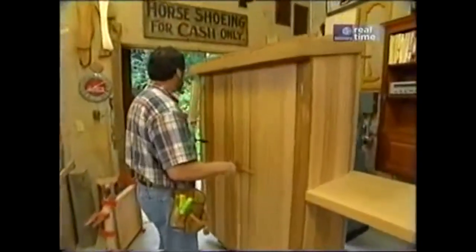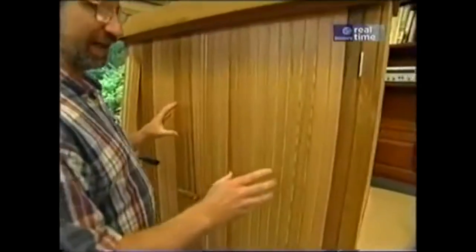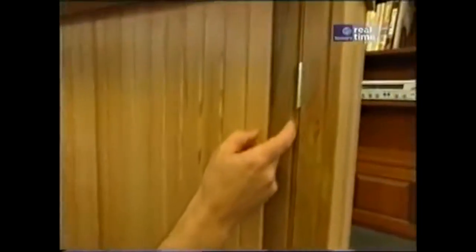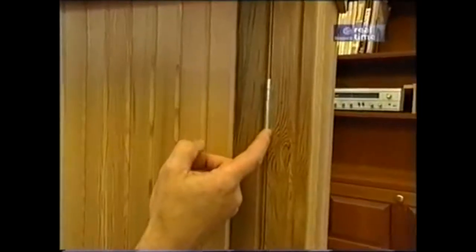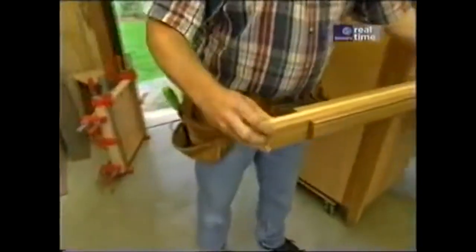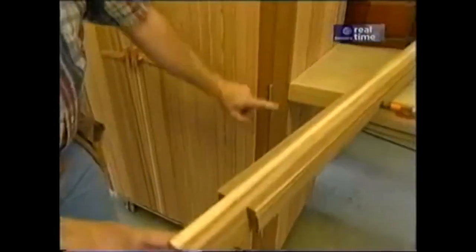While the shelf cooks, let's look at the prototype and start working on the doors. There were two ways I could have designed this piece — I could have built a face frame and hung the doors in between, or do what I did here: make it look like the siding is continuous right around the corner. So I made a joint right at the edge of one of the V-grooves, and that's where the hinge is located. I want to mortise these hinges into the door and to the fixed piece, because if I just use the screws, the weight of the door is hanging on the screws. By making a mortise, I have a shoulder, and that adds a lot of strength to the unit. I've taken four pieces of siding and ripped them to the right width. The longer pieces are the fixed stile — they go all the way down to the base of the unit. The shorter pieces are for the doors. I've laid out the mortises for the hinges and I'm going to make the mortise by simply using the table saw. I've set the blade at a very shallow height — it matches the thickness of the hinge. I'm going to use my miter gauge to guide it through, with marks on the edge so I can line it up with the blade, run it through, and clean out the material in between.